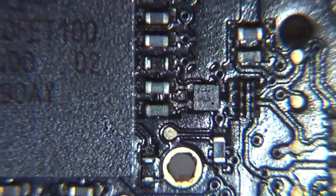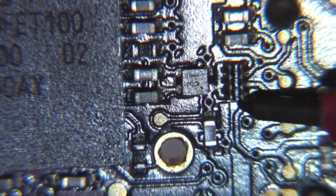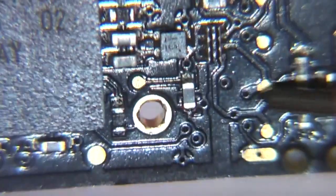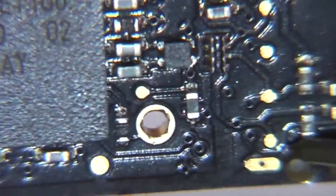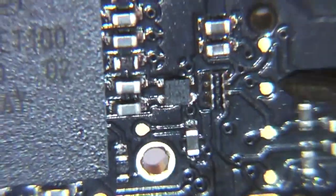supplies for the sensor. And the biggest surprise is that there's no AC signals at all on any of these test points. And in fact, if you look at this more closely, this resistor pack is actually being fed from the output of this regulator, and then, for example, this one here goes through probably an inductor or a ferrite bead and a capacitor. So these are actually separate supply rails for the sensor, so you've probably got an IO voltage, a core voltage, maybe some analog supplies on there, but there's no AC signals anywhere at all on this side of the board around the sensor.